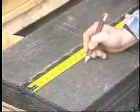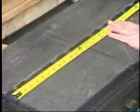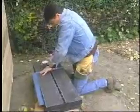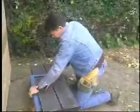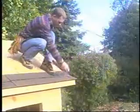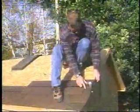Cut approximately 10 to 12 shingles on the left tab, if the shingle is facing grit side upwards. You will have to cut the shingle using a square and a sharp knife from the back side, so that the tab you are cutting will be on the right when you flip it over. Start the first row with a tab cut shingle, and then alternate with full shingles up the whole left side of the roof.